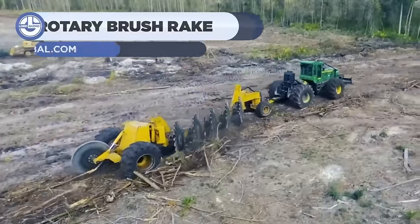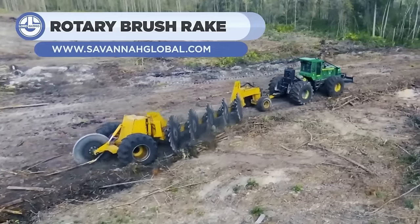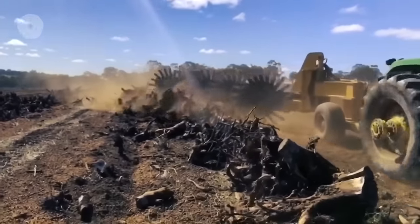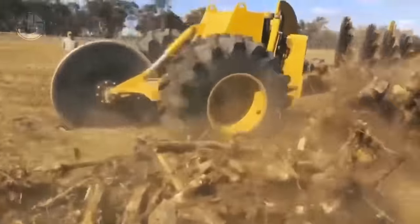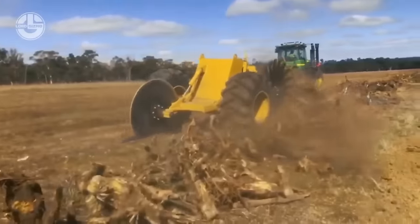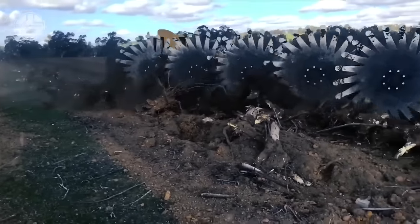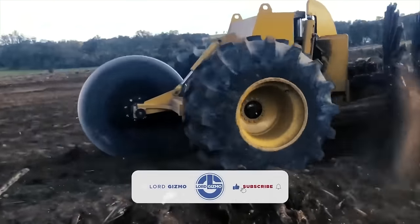These rakes are strong enough to rake in fallen trees and have previously lifted stump and root residues into large windrows. The rolling activity leaves wood residues free of soil and ideal for clean burning or biofuel processing. Production levels of 4 to 6 acres per hour are possible. The use of these powerful rotary rakes instead of the traditional dozer-mounted front push rake can be very cost-effective for large projects.